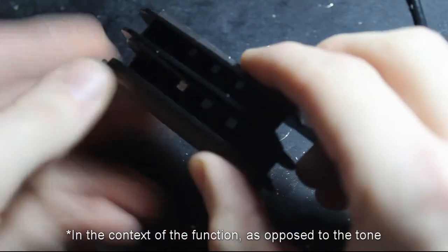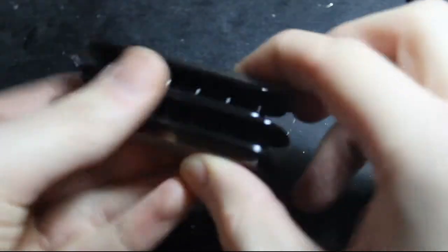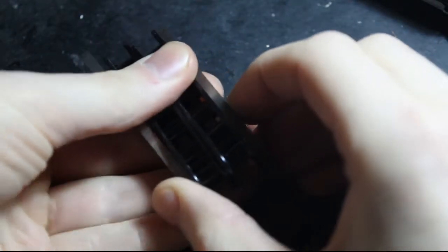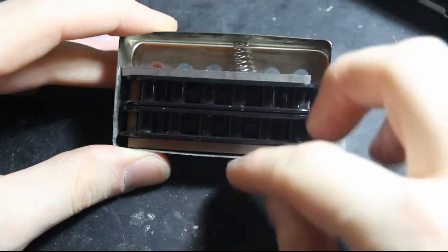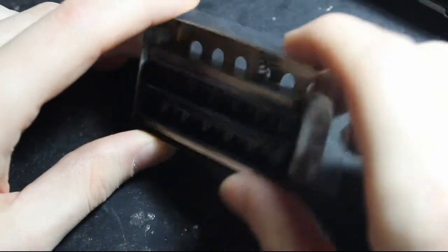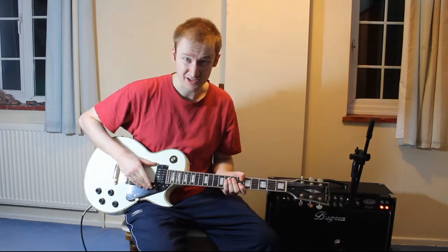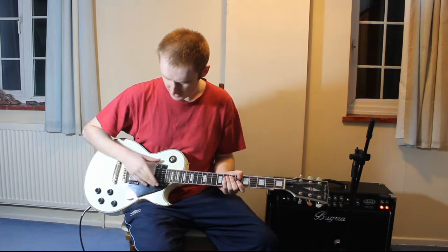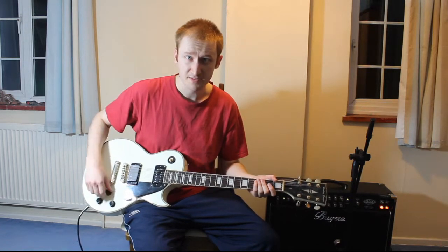Hopefully that won't change things all that much. We'll shove this all in a cover — and in order to make it fit, since a cover normally spans the full width, I'm going to push it all up against the side of the cover and have a little spring on the side that holds it in place. There we have it: our two magnets on either side, our bobbins wound with wire, and a little spring holding it all in place so nothing falls out. The pickup is built into the bridge position, and in the neck position I have my Conflagration neck pickup, which is a Stratocaster single-coil-toned humbucker. I'm going to give it the first run-through and see what the initial thoughts are.